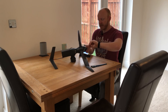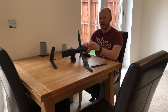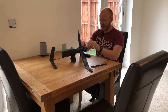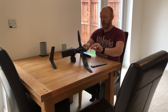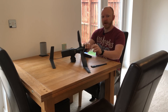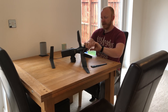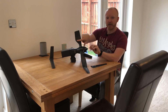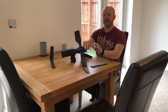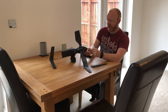I'm going to quickly take the nose cone off on camera — I'll speed it up if it takes too long. One of the main features of this design is variable pitch on the blades — essentially an auto-braking system to stop it destroying itself in high winds. The default pitch has the blades turned around, but when it goes too fast it's spring-loaded in the nose cone, causing those blades to pitch around so there's very little resistance and the turbine slows down.